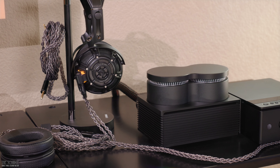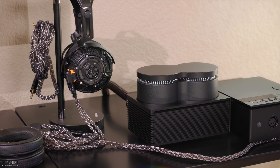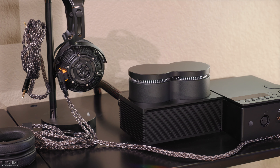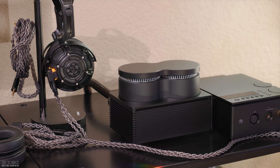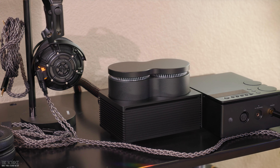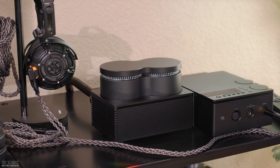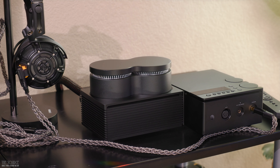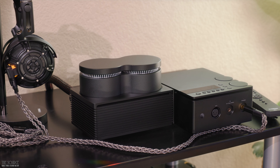The industrial and heavy-duty construction and design of the HAL7A are remarkable from a look and feel perspective and help eliminate audible impacts from internal and external vibration. The L-shaped top surface places the toroidal transformers above the power supply and away from the amplification section. The transformers are mounted onto a 2mm steel plate with beautiful housing around them, which is both superb to look at and suppresses any transformer vibration or hum from entering the audio path, allowing for quiet operation.